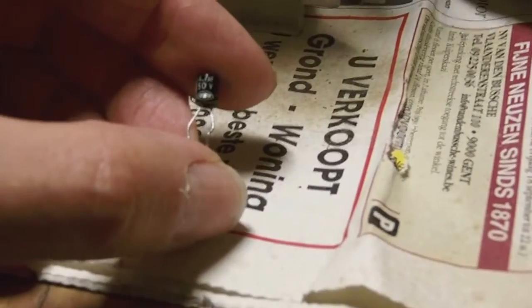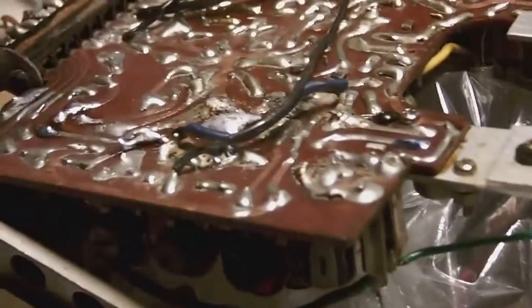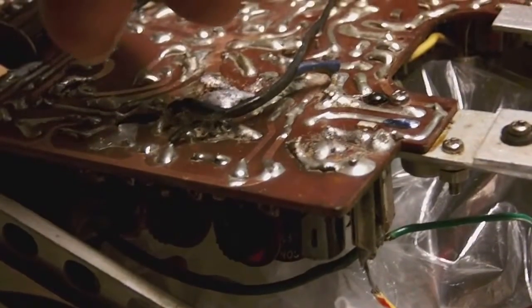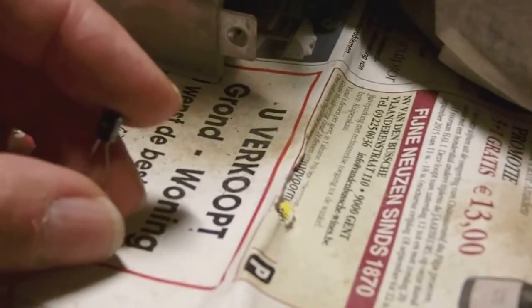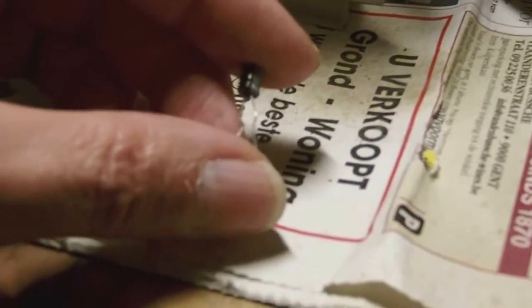So I did a very simple trick, which was I took another capacitor, another electrolytic, and I simply bridged the capacitor over that little one by touching the leads to the solder points of the 4.7. And what do you know, the image expanded correctly. And I came to the conclusion that by replacing the original transistor, which was a 2SB51, by an S9012 PNP, its characteristics are a little bit different. So the new PNP transistor probably has slightly different characteristics.